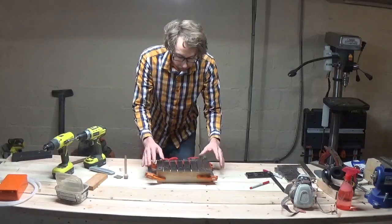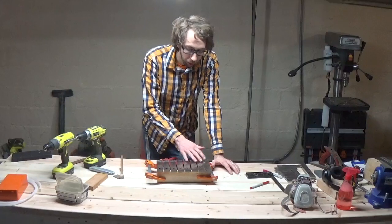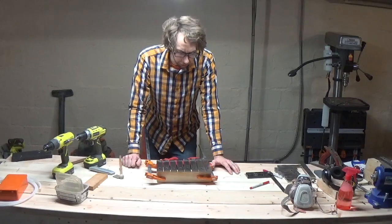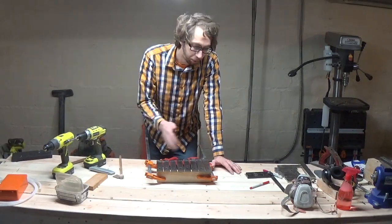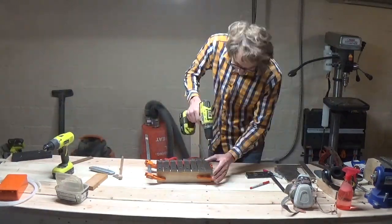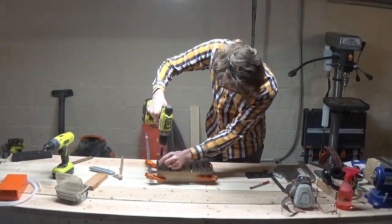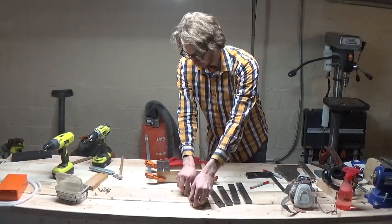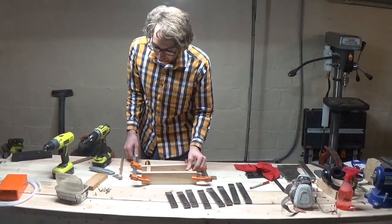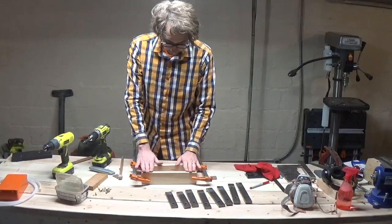I finished setting up a frame for this. Now I'm actually going to take my bars back off, polish them, and glue the frame together. I changed my mind — I am going to put wood screws in here as well. I'll do some pilot holes, drill it in, two on each side, sand it level, and then we'll be good. Then I'll put a coat of finish on it — probably shellac or just a natural oil of some kind.